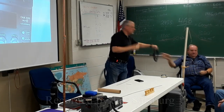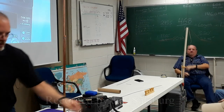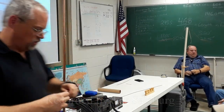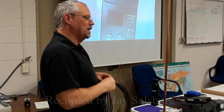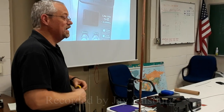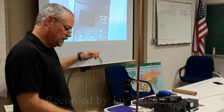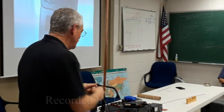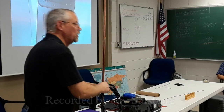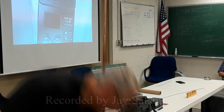So let's stretch your cable. What we're going to do is add a chunk on there and see what happens. Because I've had the same thing. I've tuned an antenna and go, I can't get this stupid thing to tune. What the heck? And then I throw the cable out and grab another cable. I hook it up, boom, and it tunes up beautifully. Then I test the cable and the cable's fine. It's not the cable. It's the length.